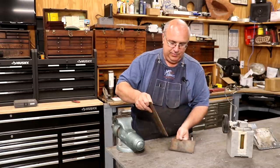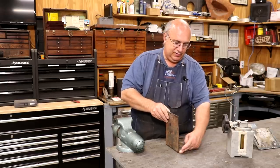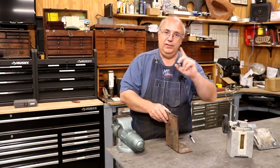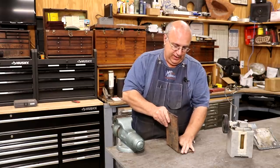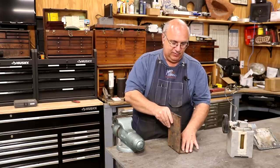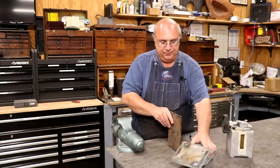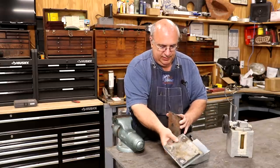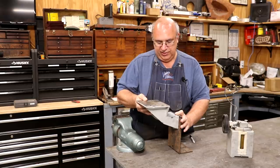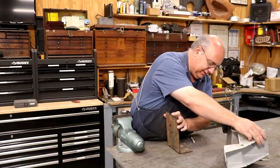And I've got some plate here. This is just some 6-inch wide plate. I think this is 3.5 inches on the back. This is going to mount to the top rail, the top cross piece on the machine, and we'll have a right angle brace in here. We'll have some brackets on the side to give it some support. We'll bolt this down, and then basically this bracket will bolt to this, and then the oiler will sit up on top of it. I think it's going to work out fine. We just got to get this thing fabricated.